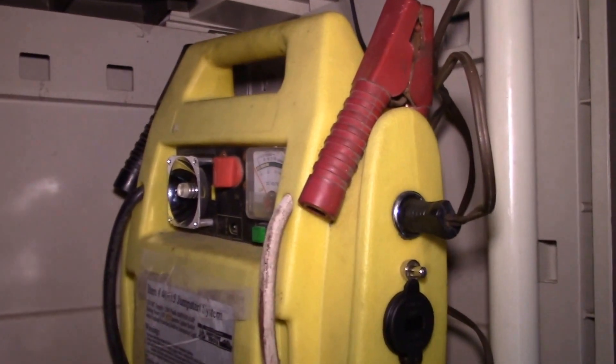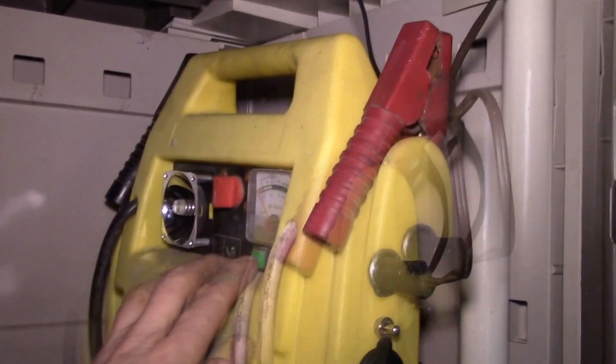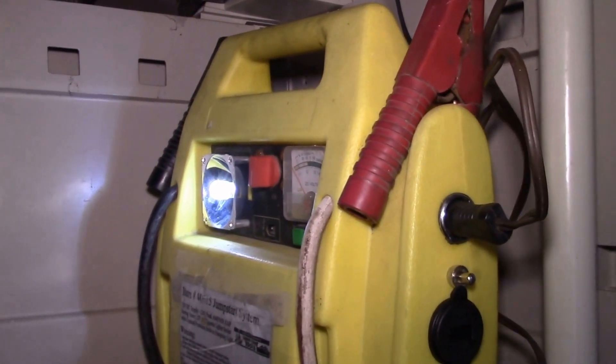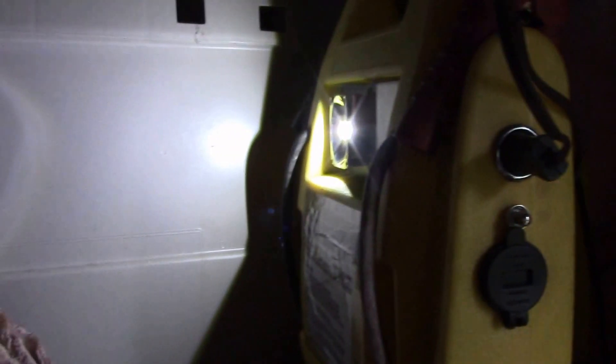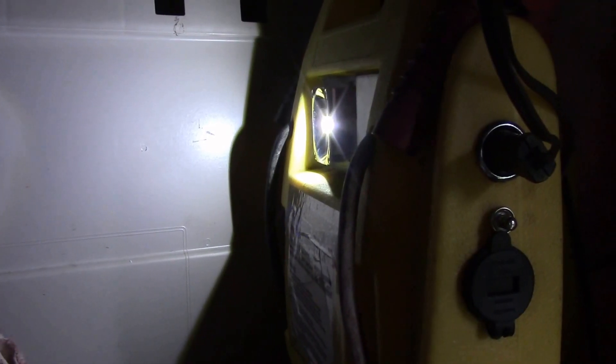Got the battery pack back in the shed. Here's the LED light — the one they call the MES bulb — measuring one watt, though it's listed as two watts. Switching over to the half-watt bulb: it's definitely dimmer and has a wider beam angle because there's no lens on the front, so it won't reflect well off the reflector since it doesn't throw much light out to the side.